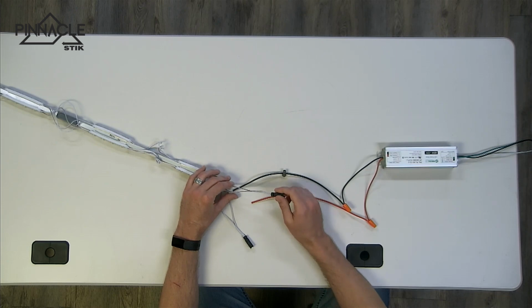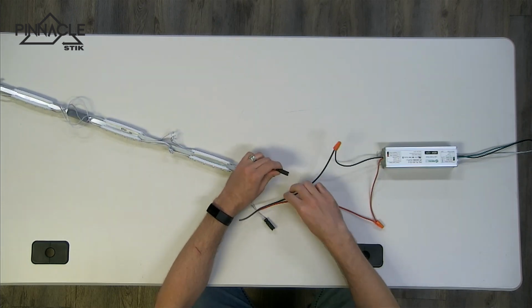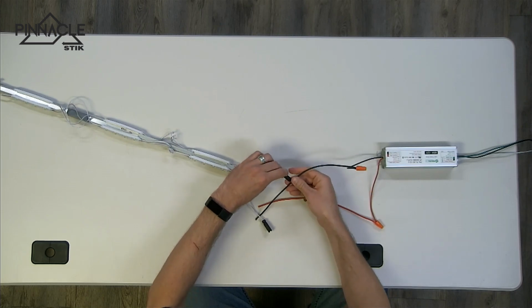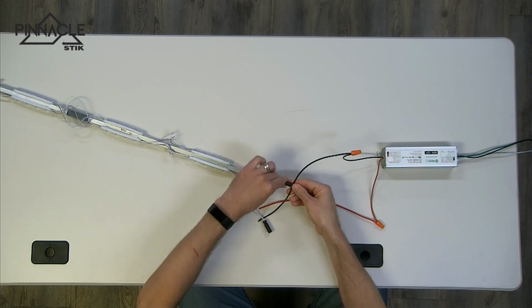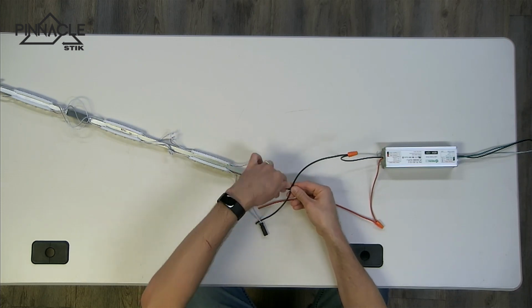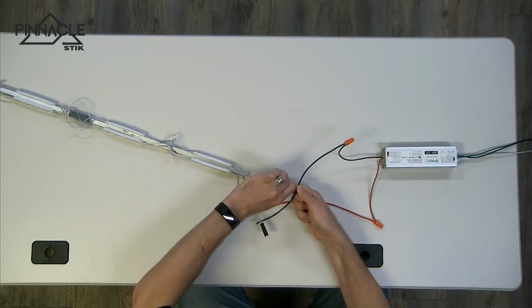However, if you'd like to avoid this, one thing that you can do is twist it the opposite direction, that you will tie it into the base. This ensures that as you screw it down onto the base, the cords will straighten out and connect without any pinch points or any twisting.